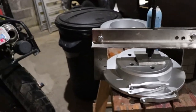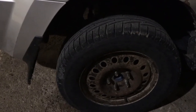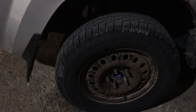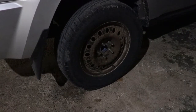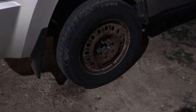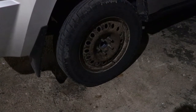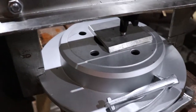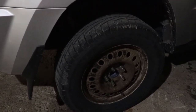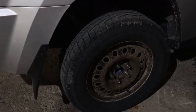In the next part of the video, which I'll probably be filming tomorrow, we'll pull the rear rotors off this vehicle. I tried to take the rear rotors off two years ago and they were stuck — you can't just keep pounding on them because you'll ruin the wheel bearings. This vehicle is kind of unique: it's all-wheel drive and sort of like a full floating axle where the axle shafts are riding on the inside and not providing any support, so you really don't want to damage the hubs because you could lose a wheel. It also has a hollow core in the axle, so I'll need to use this plate when using the puller so I don't pierce into the axle — there's a 24-inch shaft just floating around in there. In most vehicles you'll be pushing on the end of a solid axle or CV shaft and won't need that plate.